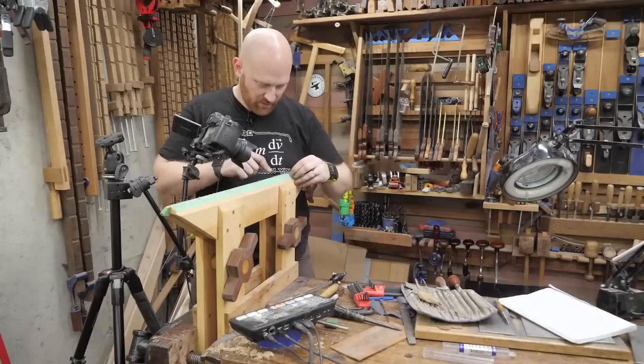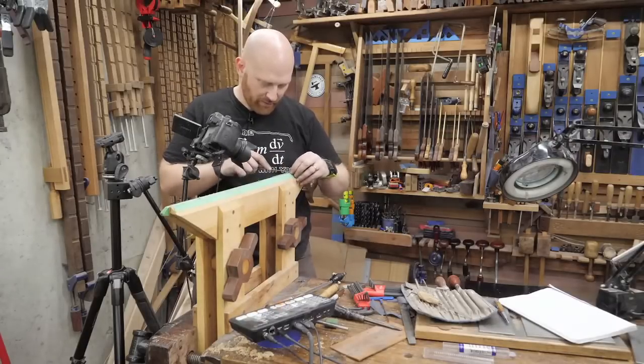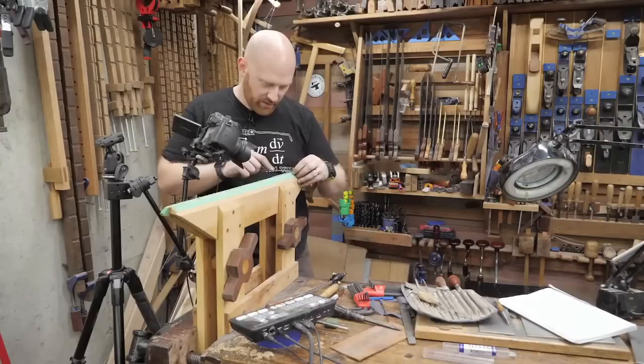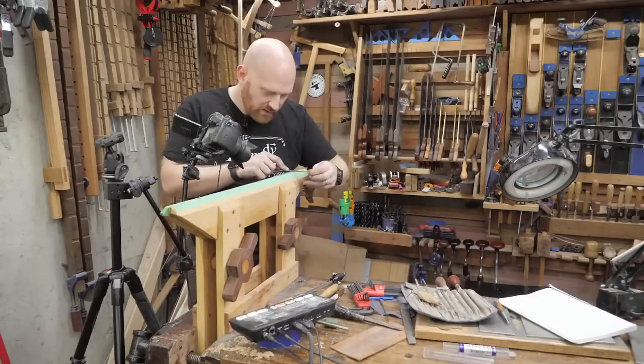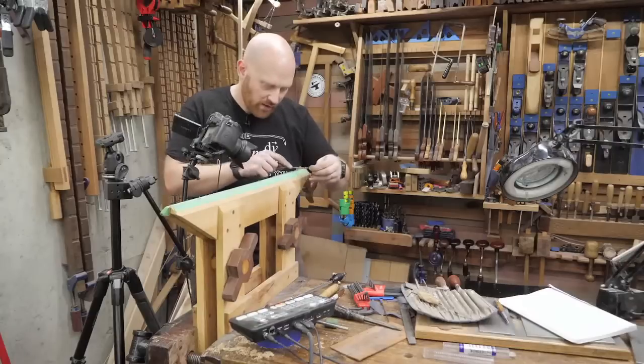You can kind of hear the pace eventually picks up as you get into that rhythm. One of the reasons why some people don't like to file it all from one side is you push a burr out onto the far side. And so the first few strokes with a newly sharpened saw with all the burr on one side means it's going to start to veer off course to that one side. But after a couple passes with it, that burr is gone and no longer has that problem. So you have a lot of people who run into the problem of, oh no, it's veering off to the side, and they go and stone it, and then they have the problem going in the opposite direction, because the burr wears off and they stoned the wrong side. I do know some people who do it all from one side and then they immediately stone the far side.